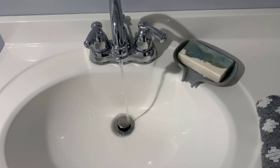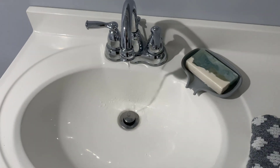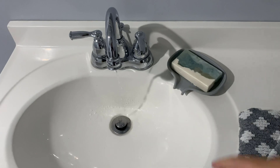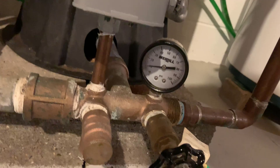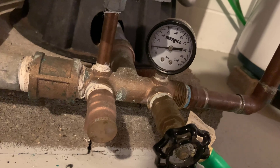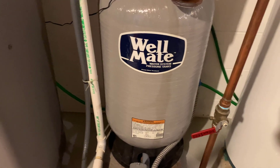Here you can see I have a shower on, and it completely turned off. I think when the pressure tank is causing the pump to cycle so fast, it overheats and just needs to take a little break — because it usually comes back after I turn off the power to it for a bit. But the pump's probably 24 years old, so I think all of this stuff is due to die. Maybe I can get a little bit more life out of it.